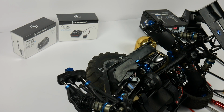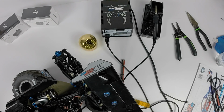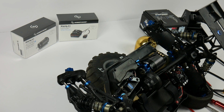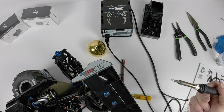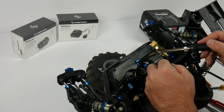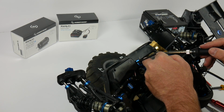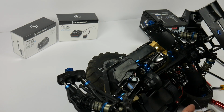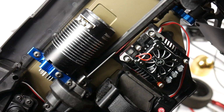Alright, so I went ahead and got a few tires. I have some 8-scale tires here to hold the arms from moving, and then I have a huge monster truck tire back here to kind of prop it up on an angle so that these things are level. Now you're able to solder and pre-tin those posts on there, so everything's ready to go. So clean up the tip here as I get ready to solder in here. There we go. And we're just going to go ahead and pre-tin each one of these posts here on the motor. Have everything pre-tinned and ready to solder some wires on.